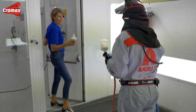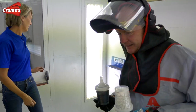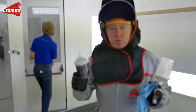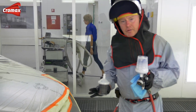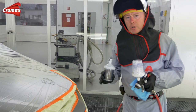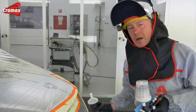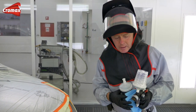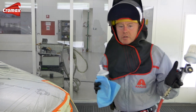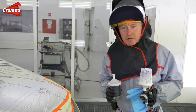Hi, is everything ready? Yeah, ready for use as you asked. Thank you very much. Okay, as you can see I have the two pots. As I've shown on a number of occasions on our channel, I've already demonstrated the blending process, but just as a quick reminder: I'll spray some blender out here, make my widest area first, then work back inside. The gun I'm using today is a 1.2, as I've done previously, so time to get the job painted.